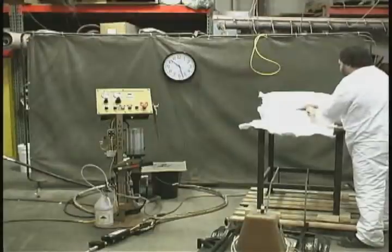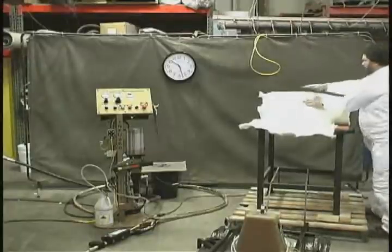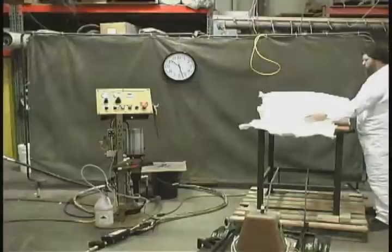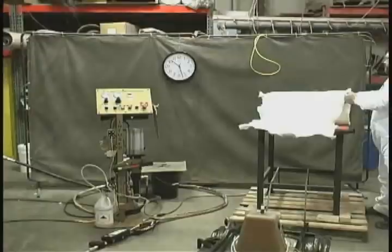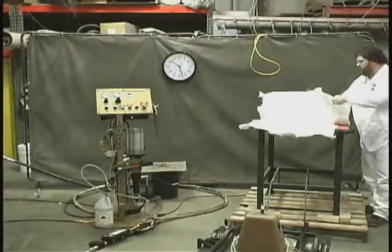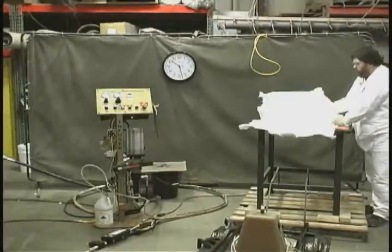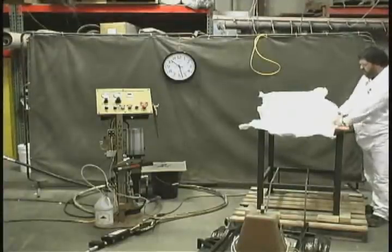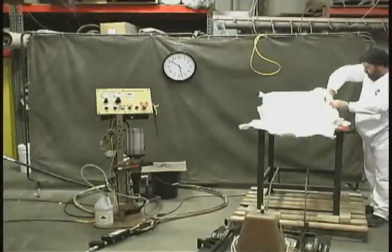Often it's a female shape but in this it's a male. Now if you remember when you saw it before the fiber was laid on, you had those changes in geometry shape. What's important is that we get the fiber tight into those inner radiuses and forming — but not loosely. We want the fiber to fill the mold cross-sectionally. The part thickness has to have the fiber touching the bottom of the mold as well as the top of the mold, which is the upper half.